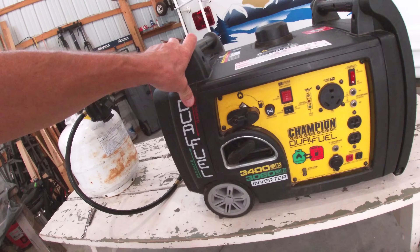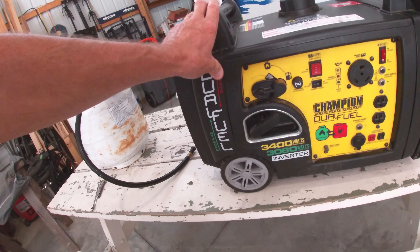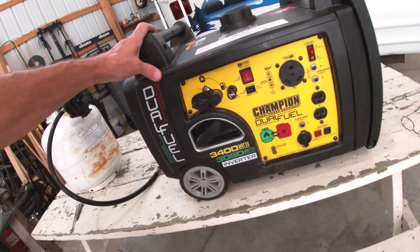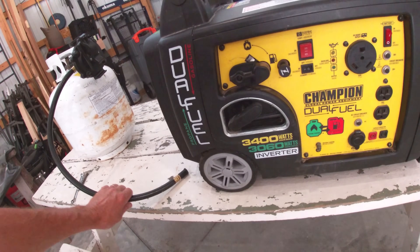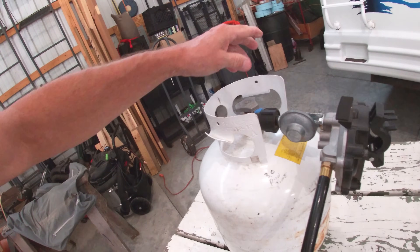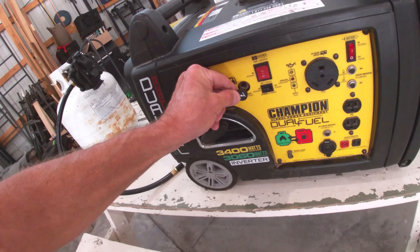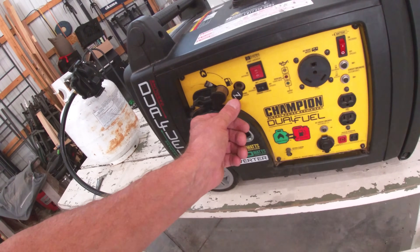Finally it cleared up and ran okay. I plugged the camper in, we were able to charge our batteries up, let it run for about an hour — it was all good. The next day I went to fire it up and it was the same thing, but now I couldn't get it to run at all unless the choke was all the way out, and it doesn't have any power that way. Plugging the camper in would just bog the generator down. It seemed like it wasn't getting enough fuel — whenever you have to run something with the choke out, that compensates for lack of fuel. You shut some of the air off and it'll run, but you don't have any power.